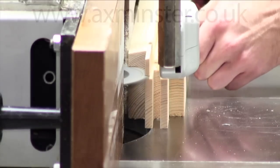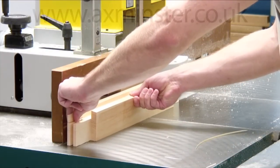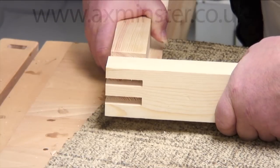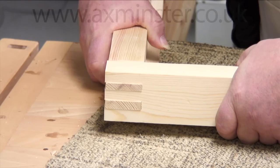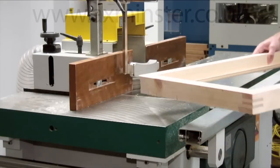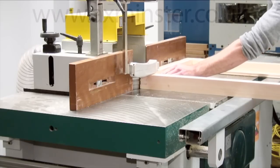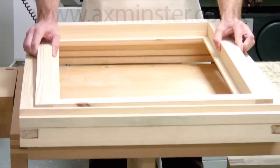Although not shown in the video, the beads are normally mitered prior to fitting; the shadow of the end of the machined component profile provides the exact cut-off point. With the beads removed, a dry fit can be carried out and then the casement components can be glued and pinned and set aside for the glue to cure. Tool Group C5 is fitted and set and the external profile for the flush sash is moulded along all sides of the square. The profile includes a water stop groove and the groove for the friction stay in the correct place and at the correct depth.